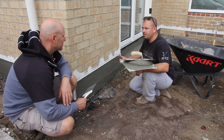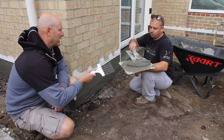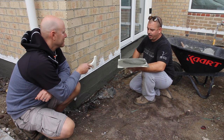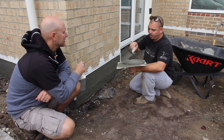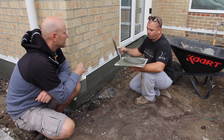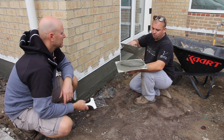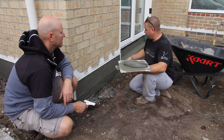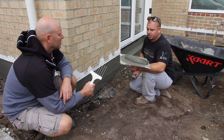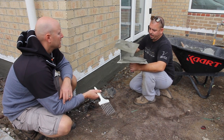Basically these lines will give a key for the next and final coat of render — the one that we'll make nice, flat, and smooth. So two coats of that. Talking about the render: I'm a big cook and I love making bread and dough. I'd equate this to dough — you know what is a good mix. This mix is probably a bit firm just because we've got some big holes in the brickwork and slab to fill up, so it's quite firm to use for rendering. The mix is three sand to one cement by weight, with some waterproof additive. The final coat won't be as strong — we cut back on the cement, make it more sandy.